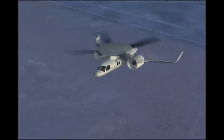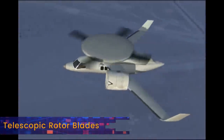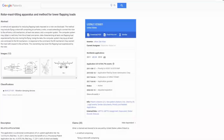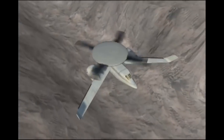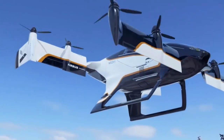It is called the disk rotor. The disk rotor is mounted on top of a compound aircraft and is used to house telescopic rotor blades. The blades are extended when the aircraft needs to take off or land and are retracted when the aircraft is in cruise mode. This helps in eliminating the drag force substantially during forward flight. The patent for this concept was filed in 2010 and it was being applied in the development of a VTOL aircraft with 400 knots dash speed. Although this concept was meant for conventional propulsion systems, it is more easily adapted for electric aircraft.